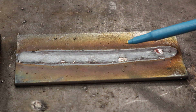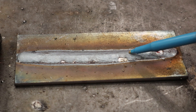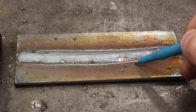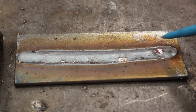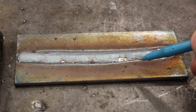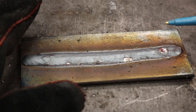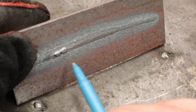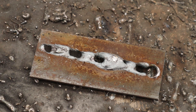This sample has suffered from settings on the machine that are just way too hot — it's got all the telltale signs. The weld bead has flattened out and gotten a lot wider. Sometimes when it's really too hot, you can have undercutting in the base material as the weld puddle robs material right out of the base metal. There is some excess carbon on here due to extra oxidization from the extra heat. Technically a hotter weld can actually be stronger because we have really good penetration, however it can have drastic other effects such as the base material starting to warp under the excessive heat.